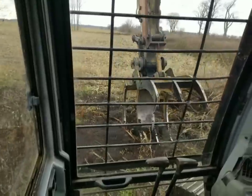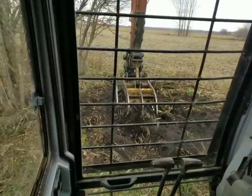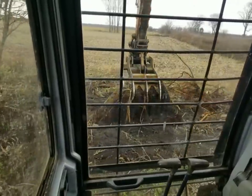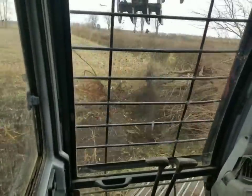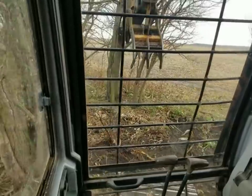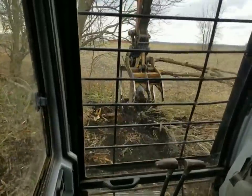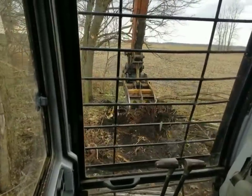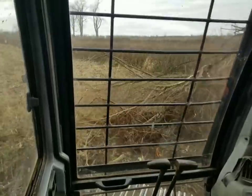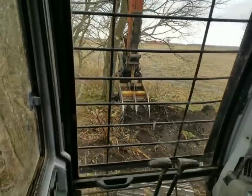There's a fence post we've got to get out — a wooden one. I'll break through and get some of those mulberry roots out. Dad Strength will come through with the loader to get a lot of those mulberry roots out with it, but I try to rake through them as much as I can. I like running these grapples because they're like a root rake also. The tines are so long on them versus using just a 48-inch tooth bucket. You don't move as much dirt with them — you can just rake through stuff.